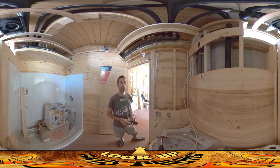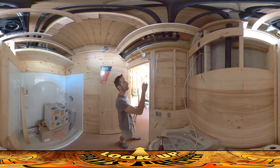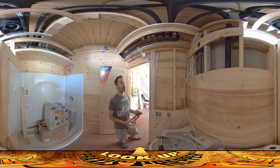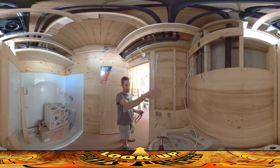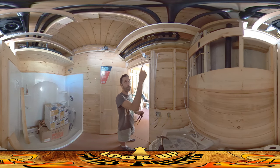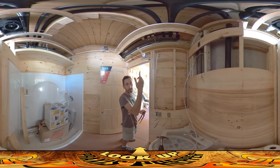To make sure I was accurate in that statement, this morning I came in and just wanted to double-check everything. There were a couple little things — a few wires didn't get labeled, a few places where things didn't get nailed down. But there was one large thing: this box right here. That's a light going to be over a mirror, which is over the sink, and we never ran a wire to it. The duplex box has a switch for the bathroom fan on one side and the light switch on the other, closer to the door — we just never ran a wire.